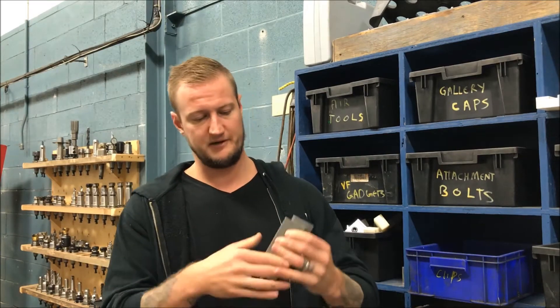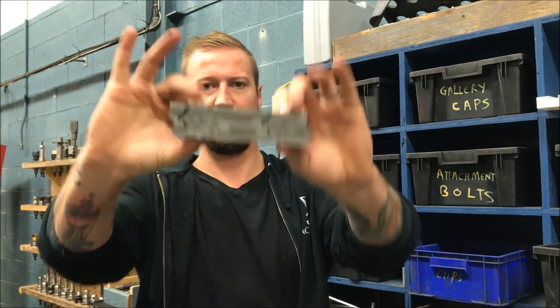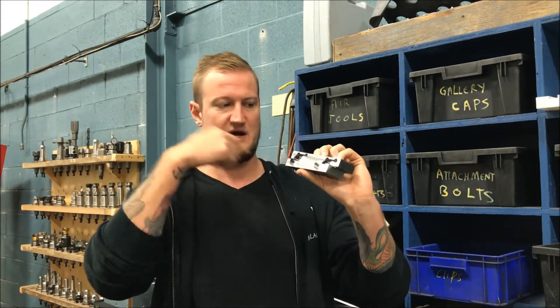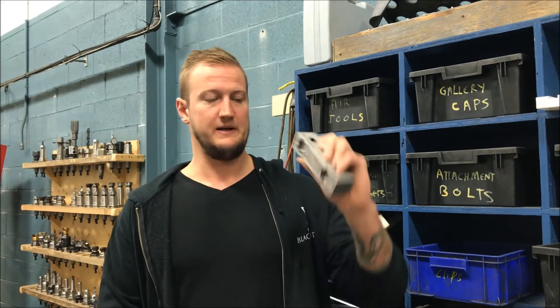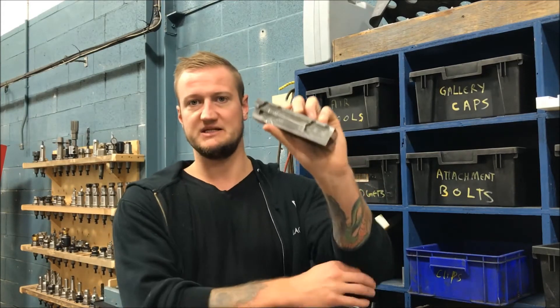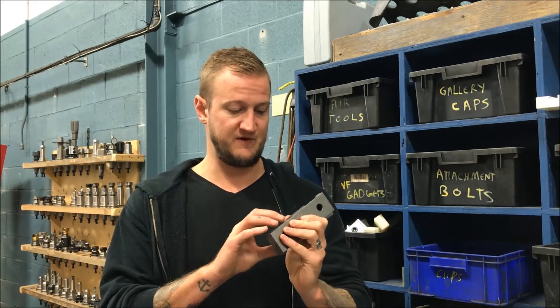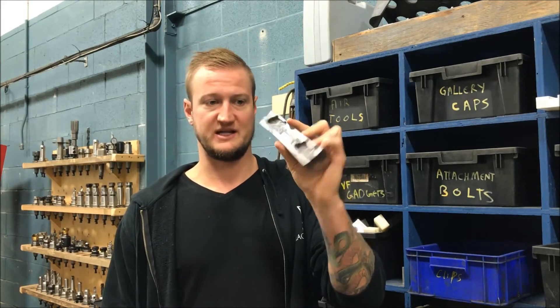So my next line of attack after aluminum jaws are steel jaws. These are hardened jaws that I hard milled. They're meant to hold a part — two parts at a time, actually — they're shaped like that. What we did with these parts is we milled that side, flipped them, put them in this vise, milled the other side. That locates them so you can make sure you can chamfer them, etc. These are really good for parts you're doing lots of. As long as you keep these clean, these things are infinitely repeatable. Very little problem getting very accurate results — to within half a tenth or a couple of tenths — out of jaws like these.